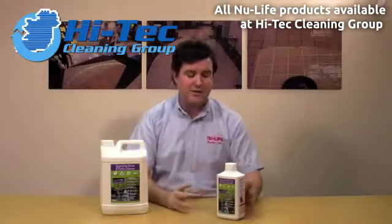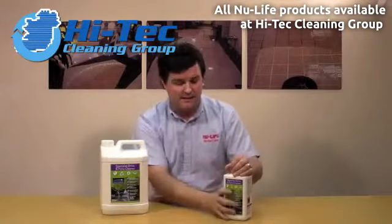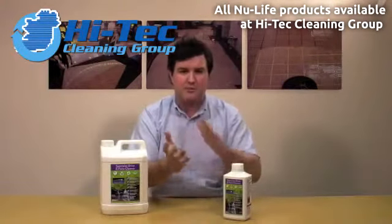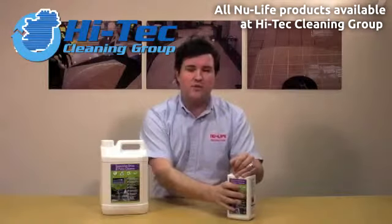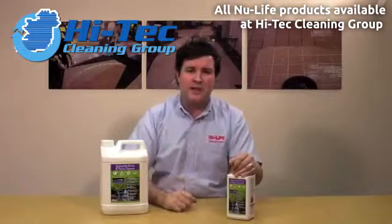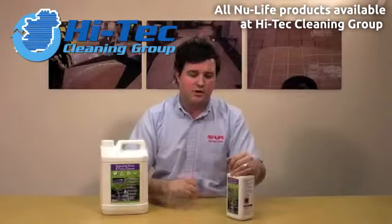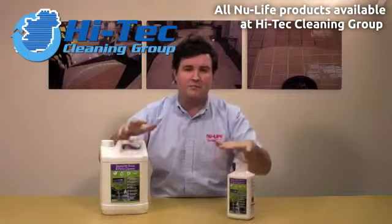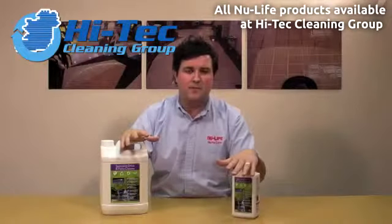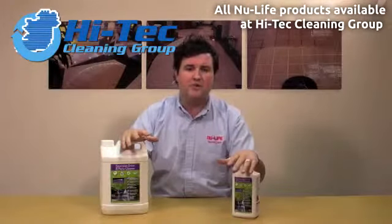You can apply it via a bucket that you're mixing in and agitate it by hand, but the best thing to do is dilute it into the spray or the bucket you're using, apply it onto the stone, make sure the water's hot that you're mixing it with, then agitate with a deck scrub or some sort of aggressive scrubbing brush, and then jet wash the area off. This is going to break down all your algae, moss and mildew — those build-ups that you get on all your external driveways and patios.